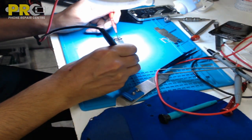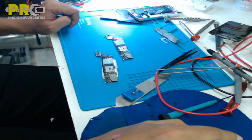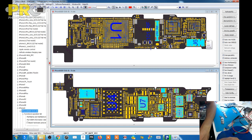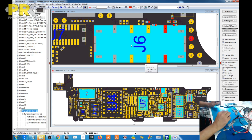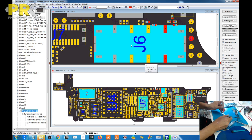So I was thinking, right, this one is beeping. So it means the short is only on this line. From here it could be any of these capacitors or anything, and over here, and that's it. And now because that thing is off, let me try to inject the voltage over there again. It's not getting anything, which is very strange.